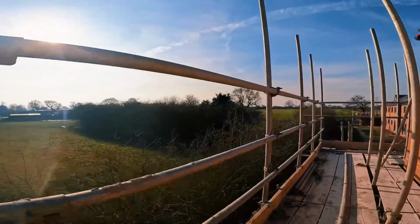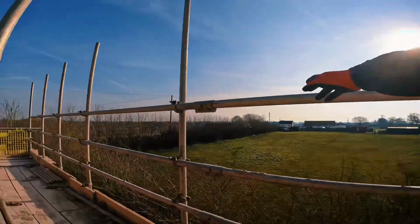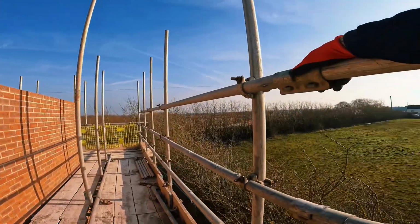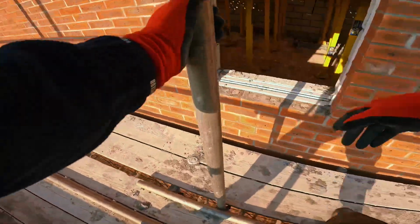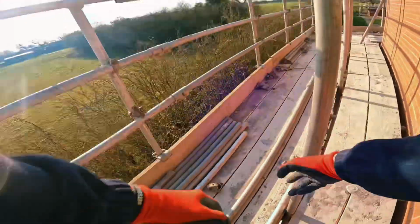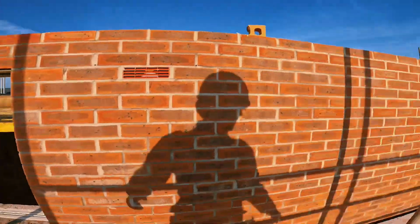My full ledger is going to be all the way in, both corners, and I'm going to work my way backwards. So this sleeve now is not in this bay. This sleeve is going to be into this bay, which will be staggered from underneath. Don't know if you can see, the sleeve's in this bay here. As long as I get it into this bay, it's staggered from this bay. That's quite legal for a scaffy.